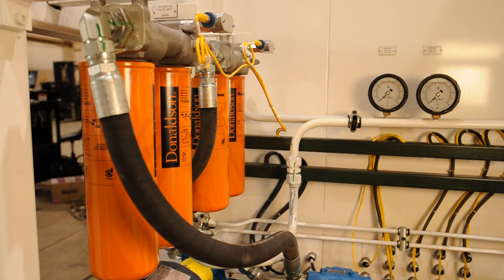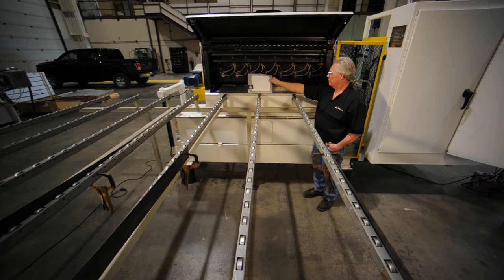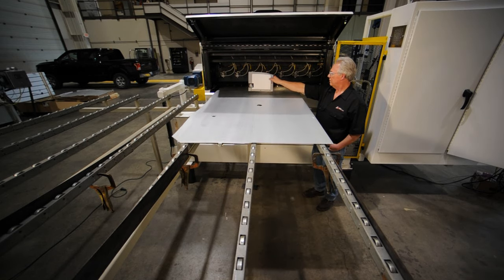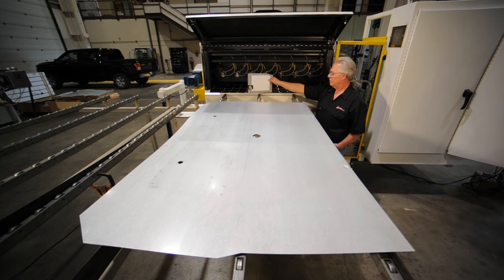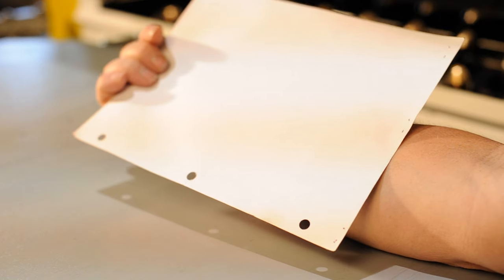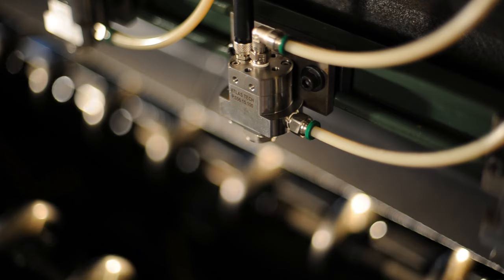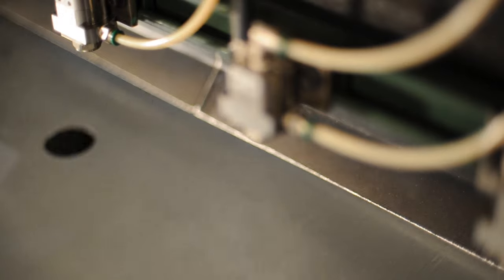Fluid filters and pumping unit, and fluid sampling ports. In this demonstration video, Atlas is applying 1.5 grams per meter squared at 35 meters per minute line speed. With the maintenance door open and holding the test media just above the blank at the edge of the metal enclosure, you can see that the test media has no oil on it. Look closely at the nozzle spraying — you will see the actual pulse modulation occurring, creating a consistent spray pattern below.